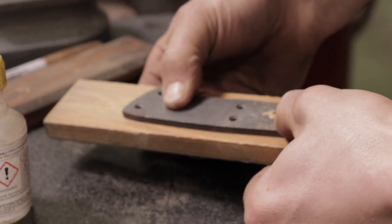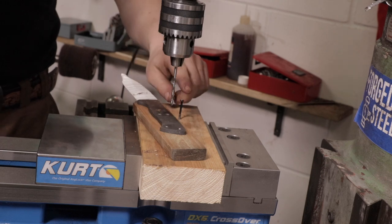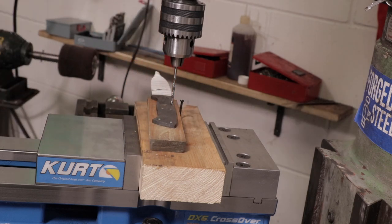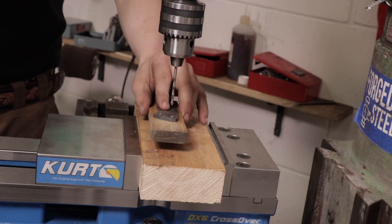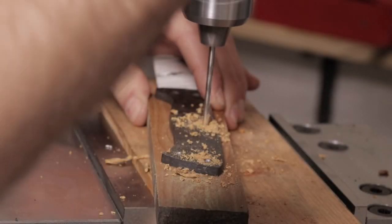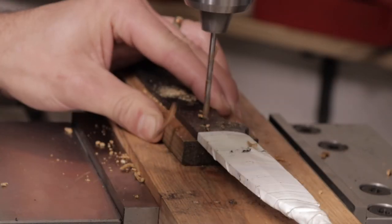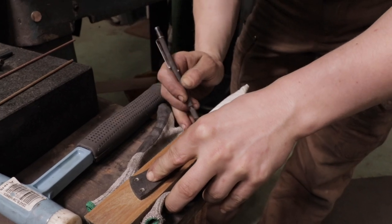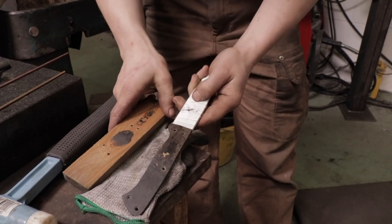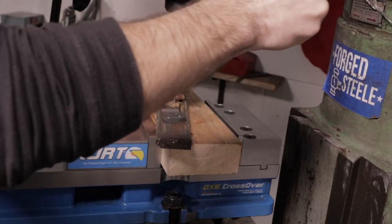Clip it over, make sure we've got plenty of clearance, let the glue dry. Pull the way through once you're into here, then pull up. It's a little screw so that should stop it spinning, but we want to be careful not to bind it. Make sure that when you lift up with the drill, you're applying downward pressure so it doesn't come up at an angle — if it comes up at an angle, we'll end up with a 2,000 RPM spinning blade. Scribe around the edges as an indication of where everything is, and then we'll super glue the scales on to the other side.